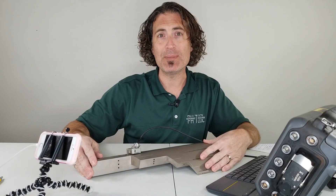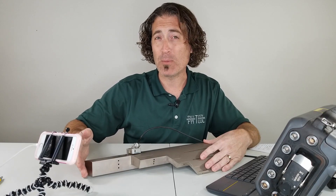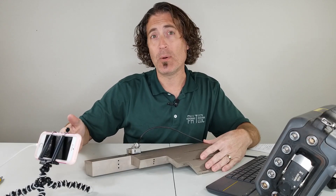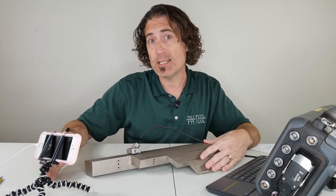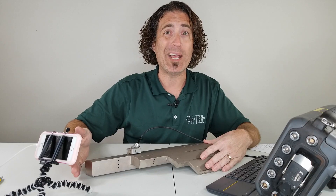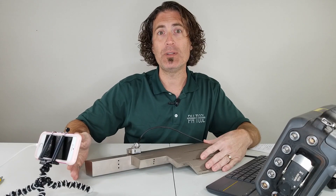If you inspect the same sizes of pipe all the time, then an ERVW block set probably won't do much for you. But if you don't know what's coming next — whether it's going to be 6 inch or 3 inch or 8 inch, and whether it'll be Schedule 40 or Schedule 160 — then an ERVW set makes a lot of sense, and it weighs a lot less than conventional blocks. I hope you found this video useful and thanks for watching.